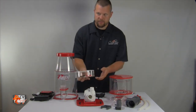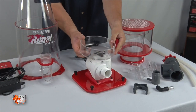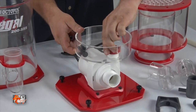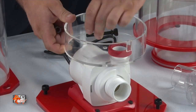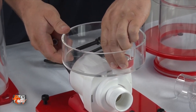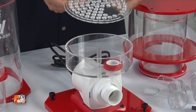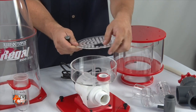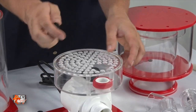We'll install the bubble chamber. Remove the lid and install it. Just firm enough to hold it in place. You have a spacer and the bubble plate — make sure the bevel end is downwards. You'll have a little notch to where the bubble plate actually will rest on the unit for positioning.